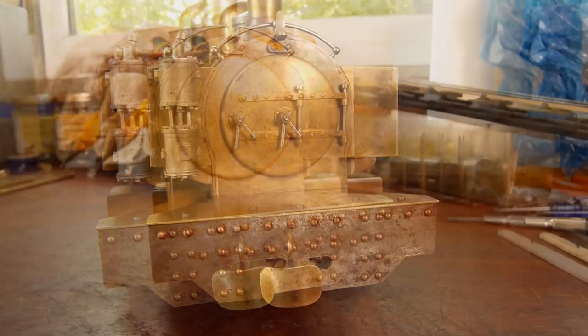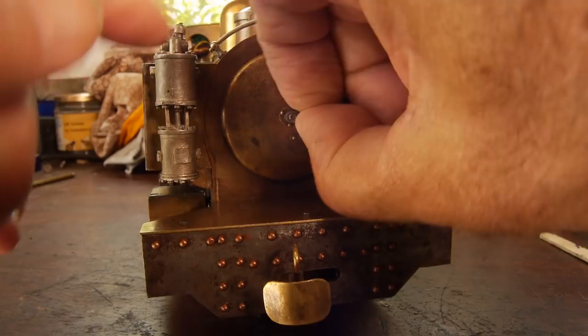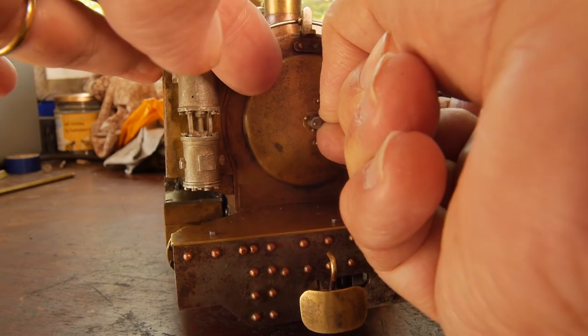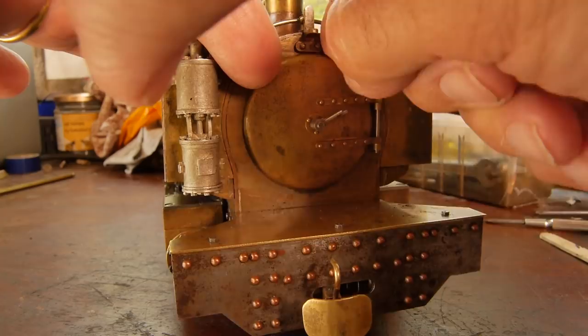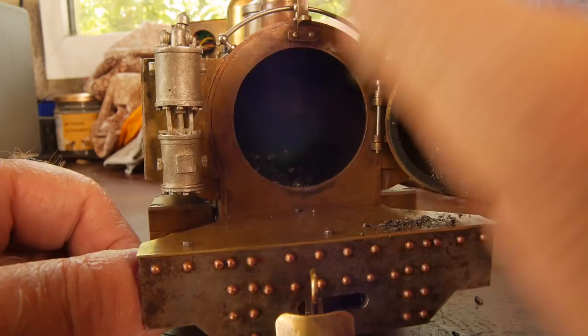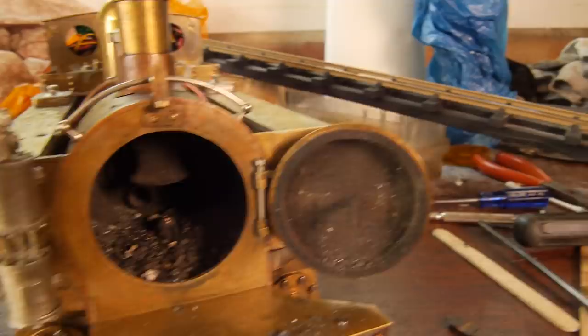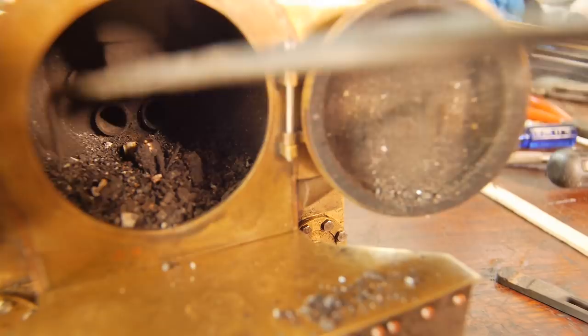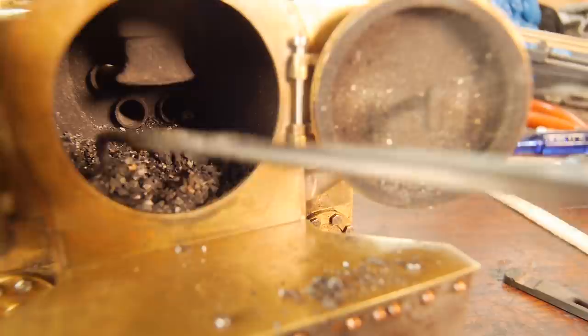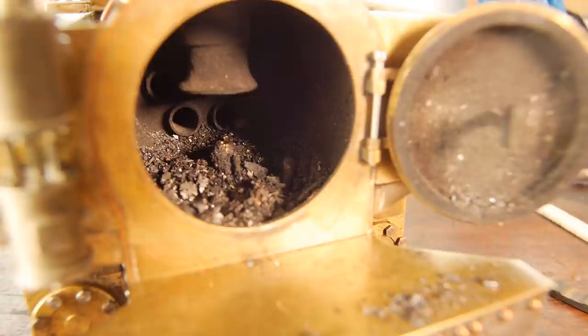I'll now swing the loco around and we'll take a look in the smoke box to see how much is left in there. Let's open up this and we'll see how much char is in there. The smoke box door is a tight fit and a bit of a struggle to get it open. That's quite full actually. There seems to be as much char in the smoke box as ash on the grate. It's not covered the bottom tubes, which is a good thing. It just goes to show you the force of draught on the fire, created by the steam blower and the exhaust nozzle, to bring that much char through the tubes while running. But the coal seems to need a high draught to stay burning hot enough. Let's vacuum that out and give it a clean up.